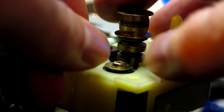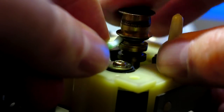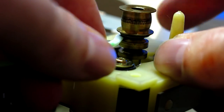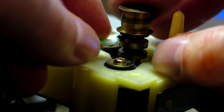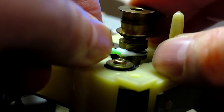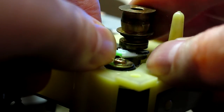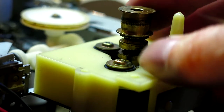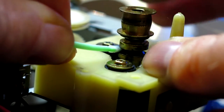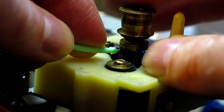Hold the front page — disregard everything I've just said about acetone. I have a can of flux remover for cleaning flux from circuit boards, which has a kind of oily base to it. Whereas acetone will eventually get you there, the problem is it evaporates so fast that it doesn't stay wet on the cotton bud. Whereas the oily base on this flux cleaner kind of clumps up and gathers the residue so much better. Like, that's going to be such a saving of time.